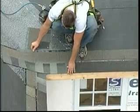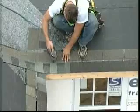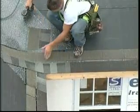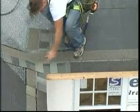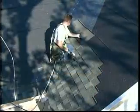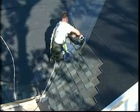For proper flow of water over the trimmed shingle, always start applying the shingles on the roof plane that has the lower slope or less height. Extend the end shingle at least 12 inches onto the adjoining roof. Apply succeeding courses in the same manner, extending them across the valley and onto the adjoining roof.